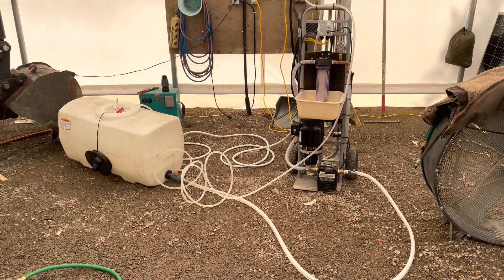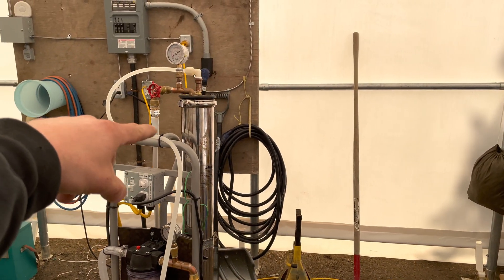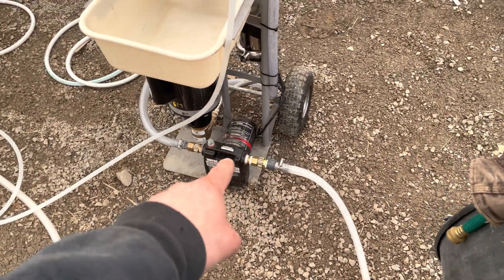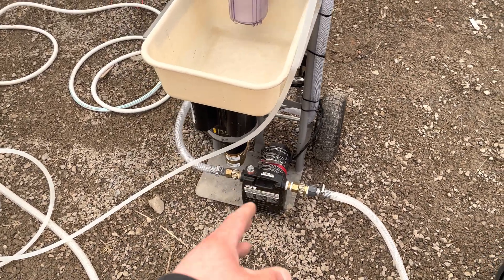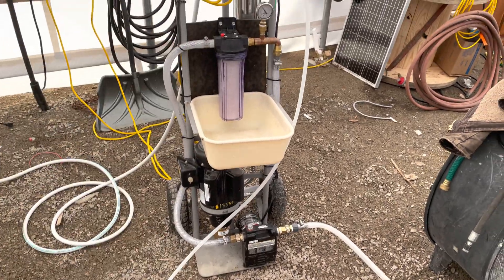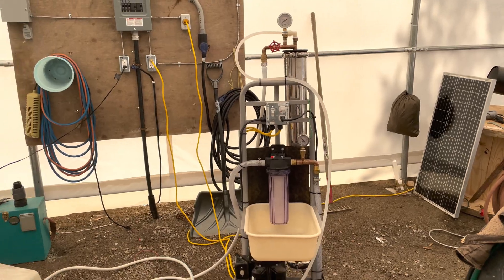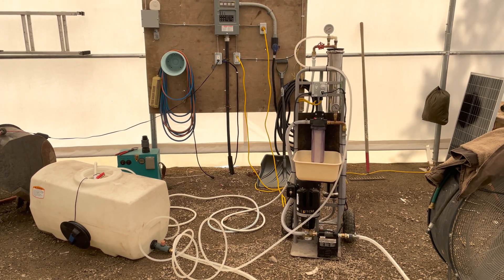For storing the actual unit: disconnect the garden hose, remove the membrane, remove the bottom plug and let all the water drain out. The pump gets used for other things around the house throughout the year. Remove the filter, dry out the housing, put it back without the filter, and you're good to go. Leave any questions in the comments — thanks for watching.